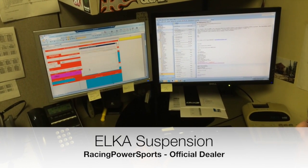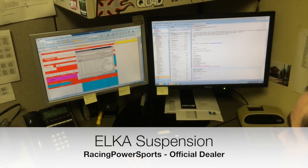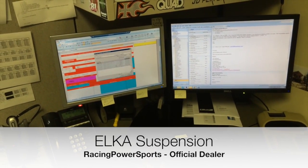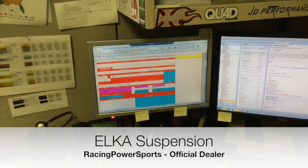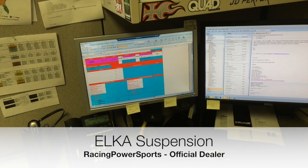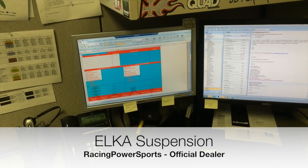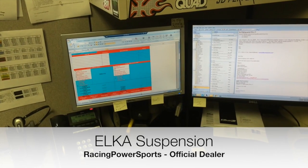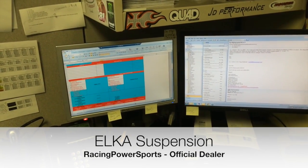Damien uses Lone Star A-arms, so we're going to put Lone Star A-arms. Stock swing arm, so we have a bunch of choices. We'll use the stock swing arm for the Raptor 700. Damien is going with the special stage 3 kit, so we're going to choose the front shocks being piggyback reservoir with hydraulic compression, and the rear shock is a remote reservoir with hydraulic compression and rebound.